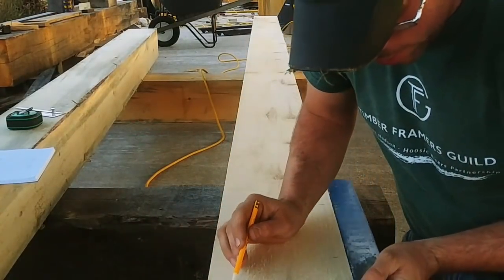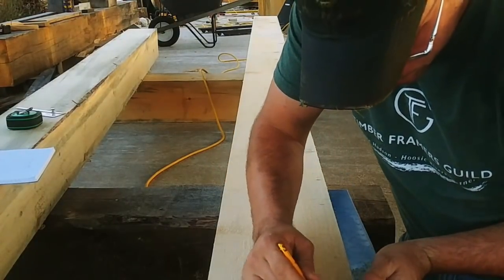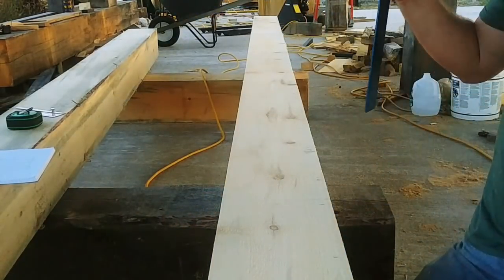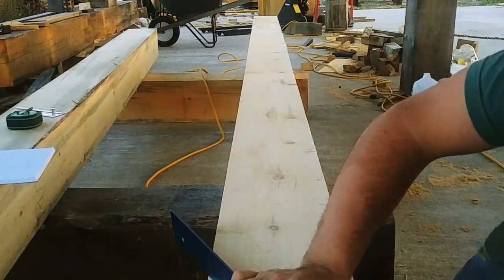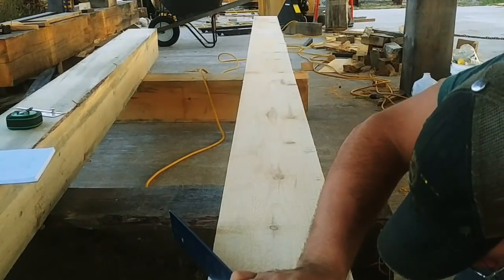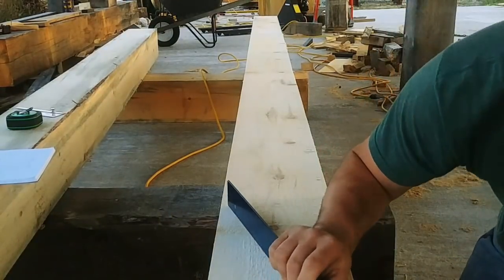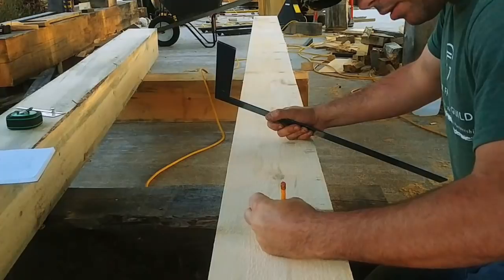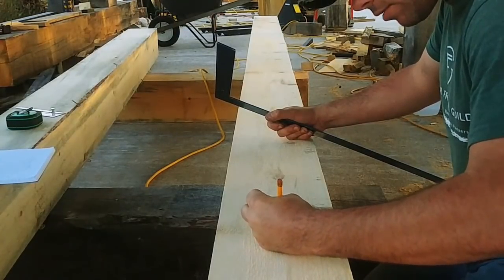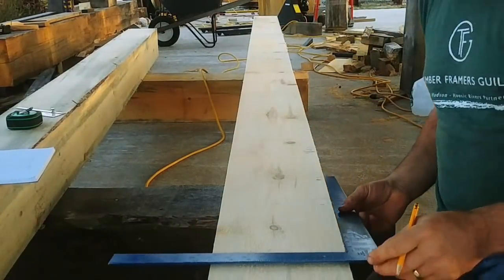So what we're going to do, we're going to lay this tenon out. Now this tenon's a 2x2 layout. The nice thing about these being the 8x8s, the best part is my saw, I can cut this from both sides and get the whole thing. Right here, this is going to be a big through mortise. Like I said, we plan to do the Dutch style tenons on this.